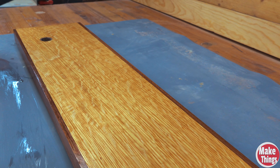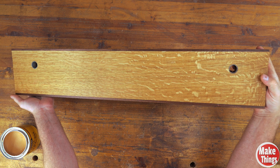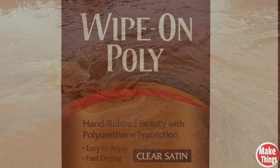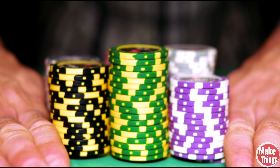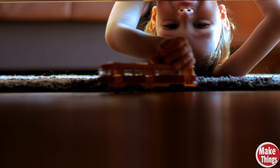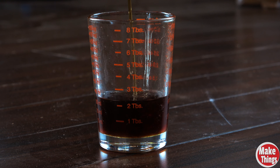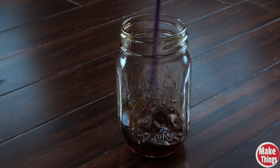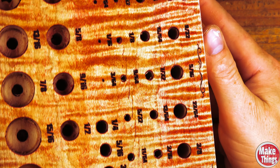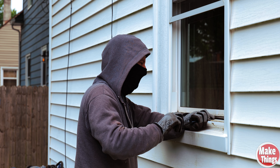I started using Danish oil, but instead of adding a couple coats, I allow it to dry over 24 hours and add a layer of paste wax. It does a much better job at repelling water and can be buffed for an incredible luster. If you're still buying Wipe On Poly, you should know it's actually a watered-down version of regular polyurethane — and you pay more for it. You can make your own at home: add three parts poly to one part mineral spirits or paint thinner in a glass jar. You can even experiment with different thicknesses for different wood densities — with curly maple, for example, more thinner lets the poly penetrate deeper into the dense wood.